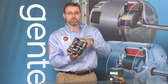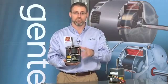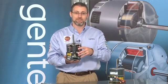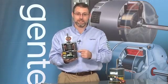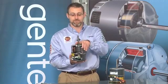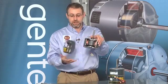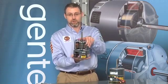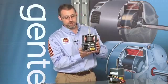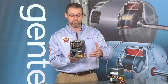A lot of manufacturers wanted to mount their motor shaft up, and if you do it shaft up we realized very early that the control can basically becomes a swimming pool. Somehow water is going to find its way between the motor and the control and cause damage to the motor. So whenever you see our motor mounted in a shaft up application you may notice that the control looks a little odd. What we literally did was turn the control upside down so we still have that molded portion of the can on top forcing the water to roll off.